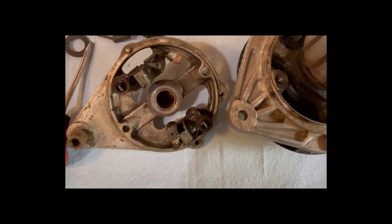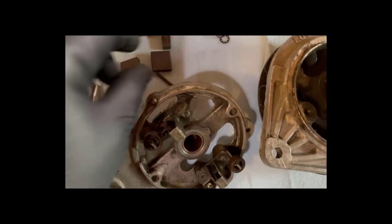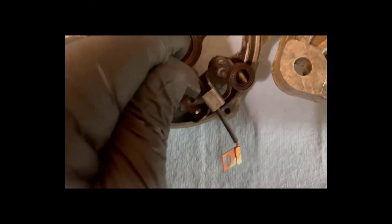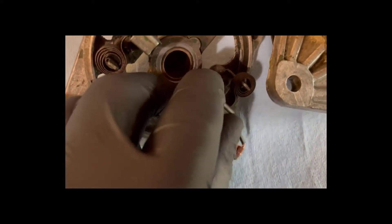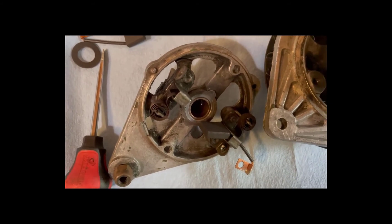Putting the brushes in is really pretty simple. We see the old brush — not much left. The new brush; we have two of them, one on each side. The way they go in is really straightforward — you just put them around the spring, push them against the spring like that, then bring this over and tighten it in with a screw. When you put them onto the armature, you just push them into their little seating and it will hold them really strong against it. That's what we're going to be counting on to help make this thing efficient, especially since we've cleaned everything up. It was so carbonized it's hard to believe it was actually generating any charge.